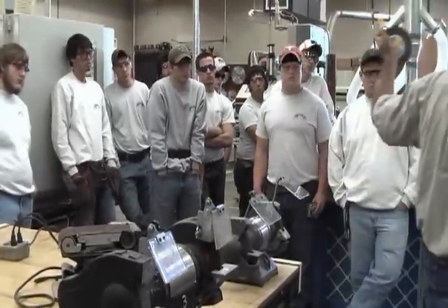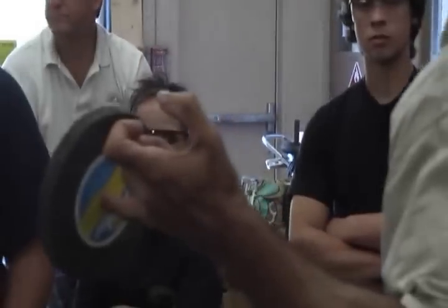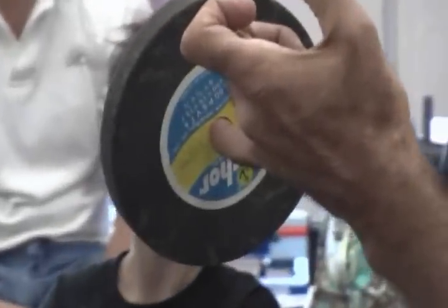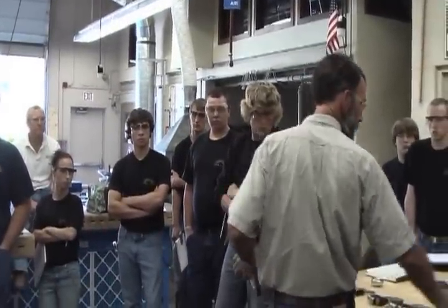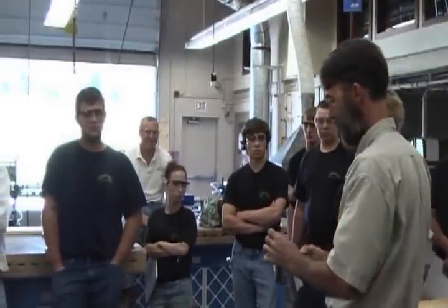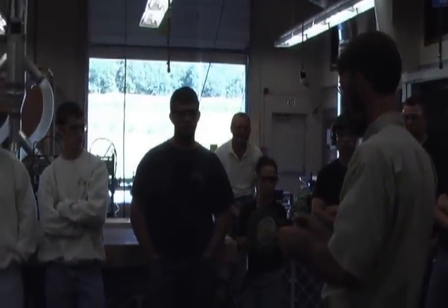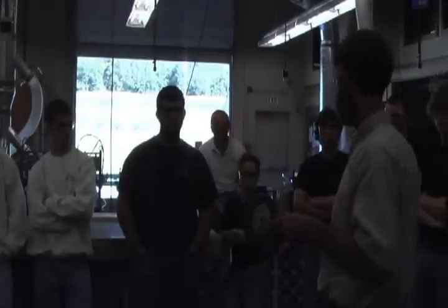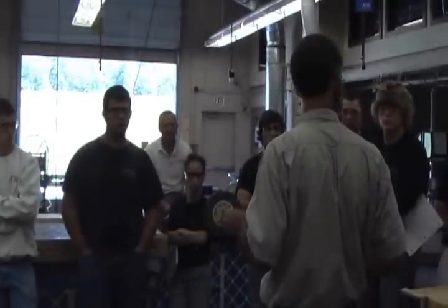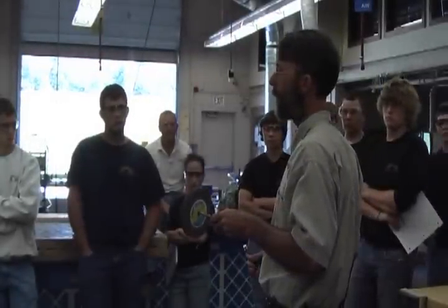How do you tell a good stone? You just got a box lot at auction? Don't you flick it? Yeah. You ring it. You hang it on something, and you ought to be able to tap it and get a little bit of a ring out of it. That's kind of a dull ring like bells, but it rings. That tells me it's not cracked. You get a dull thunk out of it, you probably have a crack with it.